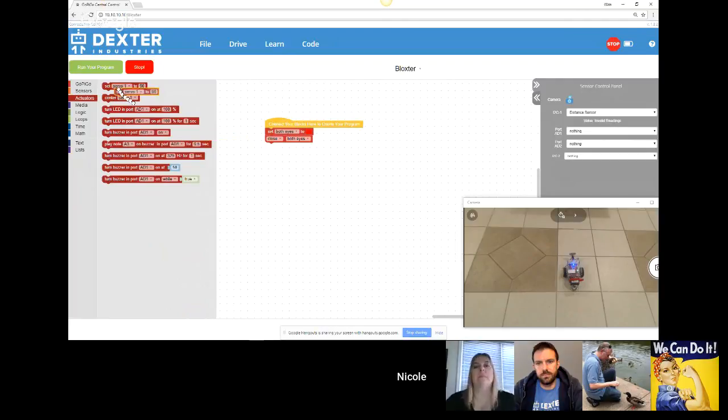And this one, I didn't even double check. Let's see if it is connected. It has a little servo, which is a code name for a little motor. I'm going to set it to 40 degrees. Yes, it is connected. And now I'm going to center it again. The distance sensor that I have in front is connected to that little motor called the servo. The GoPiGo comes with 2 servo connectors. Right now that servo is connected to servo 1, and you also have servo 2 if you wanted to add another servo.